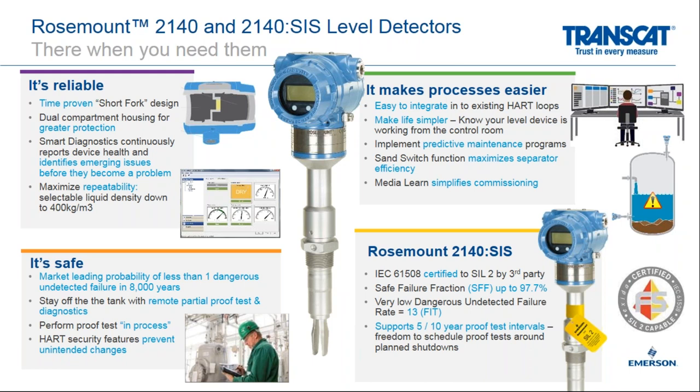That's a great question. So when we have a condition where we have sand detection, we can set up either the frequency band. For example, this nominally operates at 1400 hertz. We could have it set up so that when it encounters sand, it changes status. We present an alert to the control system. The other thing is the digital on and off value of 0 or 1 is also triggered once we have a certain frequency range encountered by the fork itself.